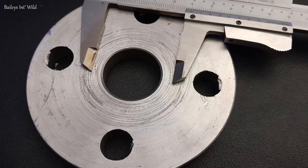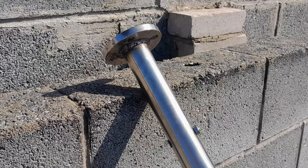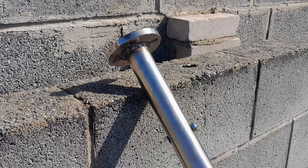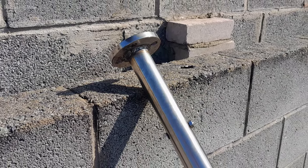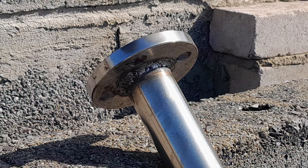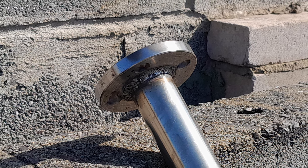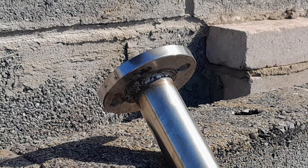When we finally got it apart, we took it to a local engineering firm to get a brand new flange welded onto the pole. The engineering firm welded the flange onto a stainless steel sleeve and then bolted the sleeve to the pole. The alloy of the pole and the stainless steel sleeve will react with each other over time, but hopefully we will have a new stainless steel pole before it gets too bad.